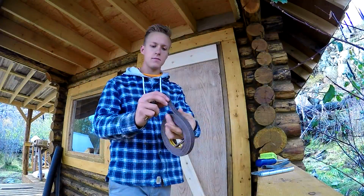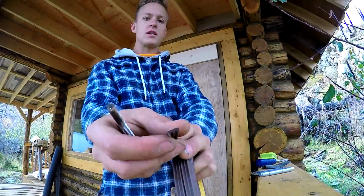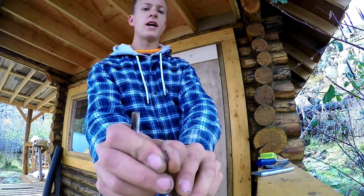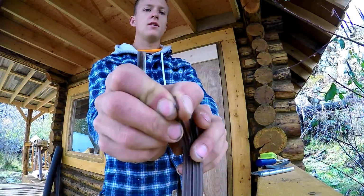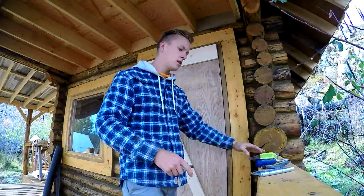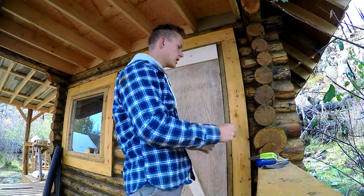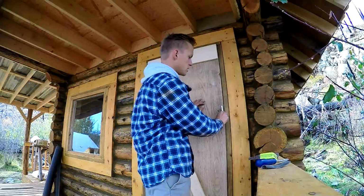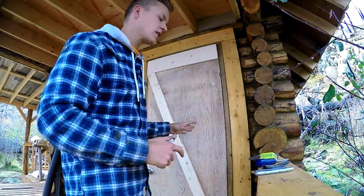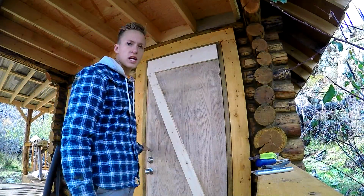this stuff. So as you can see, this is gonna go on the door stop, and when it compresses, maybe a 1/16 of size there. So I want to leave a little bit of room for that. So I'm gonna get this down, mark these out, chisel it out so I got this sitting flush, and then I'll get that all put together and show how you just kind of notch out for your deadbolt and handle.